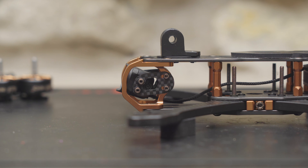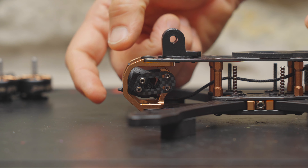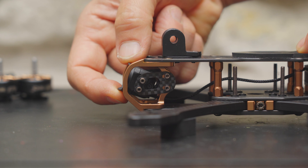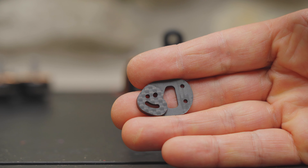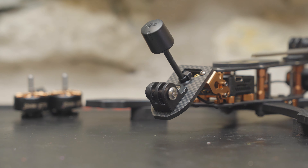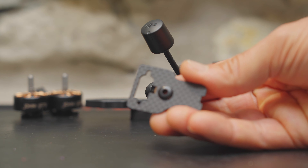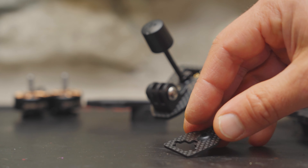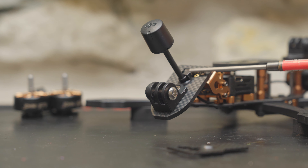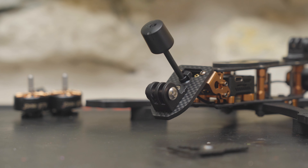The spacing of these rubber grommets is directional, meaning they provide slightly more space if flipped around, so you can install cameras of different thickness with the same plates. Be careful inserting those rubber grommets into the carbon camera plates because you don't get any extras and you don't want to break one — you can use the dental floss trick but I just used a small driver. These 8mm screws do bottom out inside the camera, and I'm assuming that's on purpose because it seems to have just the right amount of dampening, but it also means that if you want to firm up that mount you'd have to swap the screws out.